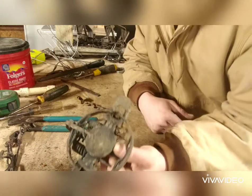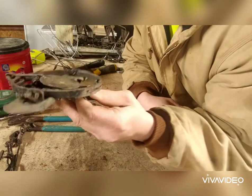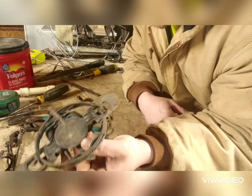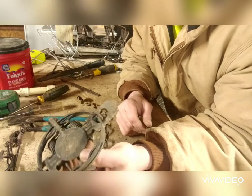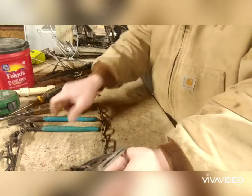There it is. See, we're at night latch. We just hit our night latch, but our pan's way down. See our pan's way down? So we need to bend that dog out a little bit more, and I'll file that night latch down a little bit more.